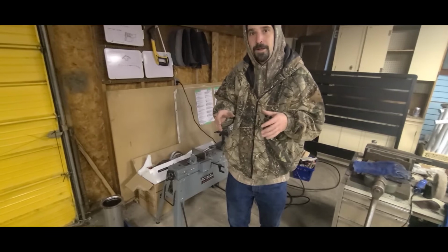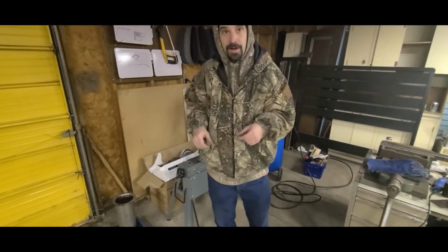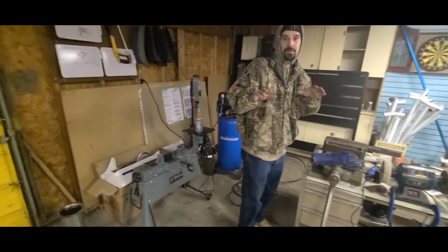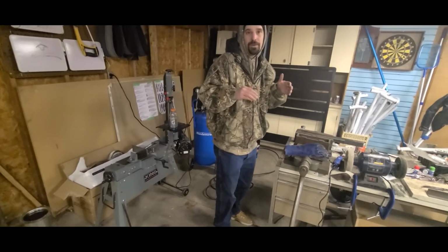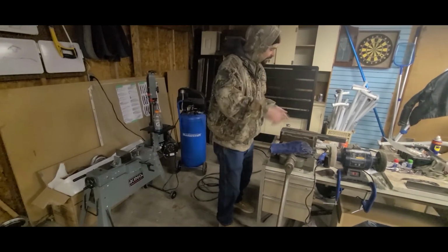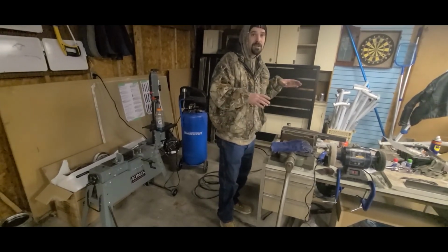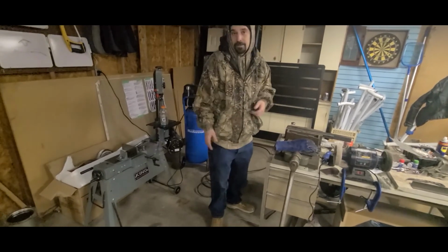Okay? And then from there, after you pull it out, you're going to have a very short period of time until it gets to about 200 degrees. Once it drops below 200 degrees, you will not be able to fix warps. So we're going to go directly over to the vise and put it between 2 pieces of angle iron and clamp it down and let it finish cooling locked like that. That is to stop any warps that could occur. And that's basically what's going to happen here.